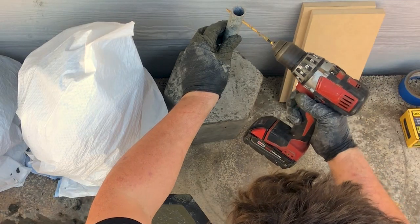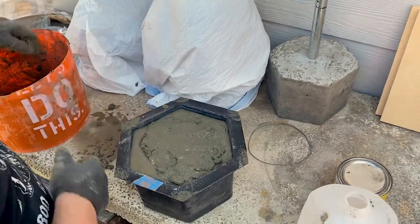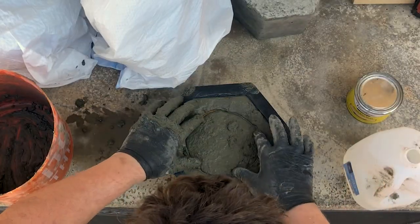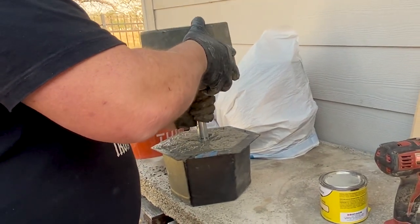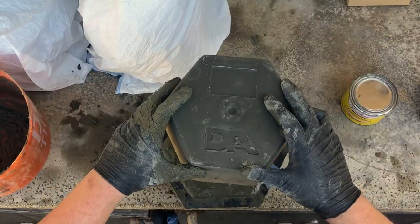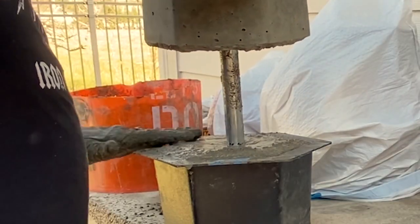Have your screws in the other side of the pipe anchored down, then mix and pour the same weight of concrete you did for the first head. Set your rings of rebar, find your center index, and reset the handle with the already-set concrete head on top, balanced perfectly. I personally put a piece of tape on the bottom of my dumbbell molds where the lip is so I know where it's set — I like both sides facing north and south so the DA is on the bottom and the number rectangle is on top, even on either side. This ensures the hex corners all face the same direction on either side, so it sits evenly on your dumbbell rack without rocking.